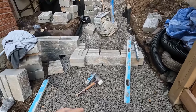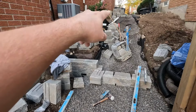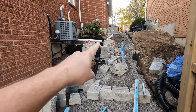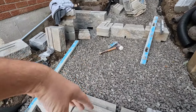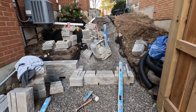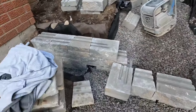Okay, when we're building these, I just know that based on my patio, all the way to the top of that sill up there, or the bottom of it, was where we're going to aim for. I know that that is 7.5 feet. So if I measure the 16-inch depth of each of these treads, I know that I'm going to fall 8 feet short. So we need a 4-foot landing, 2-foot landing, 2-foot landing to make up that. As we build up the steps, I can visualize where those landings are going to be based on the grade here and based on the grade here.